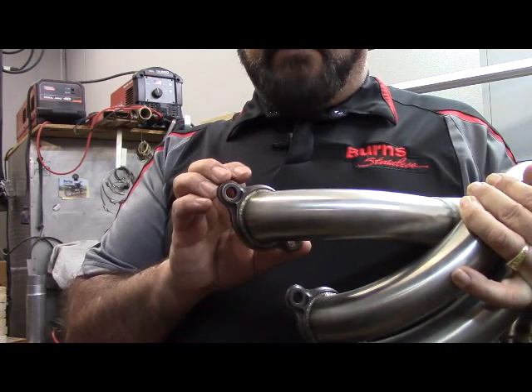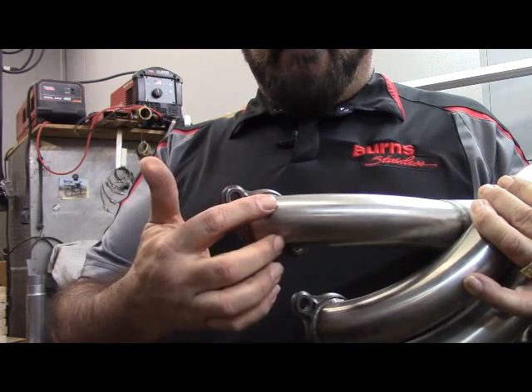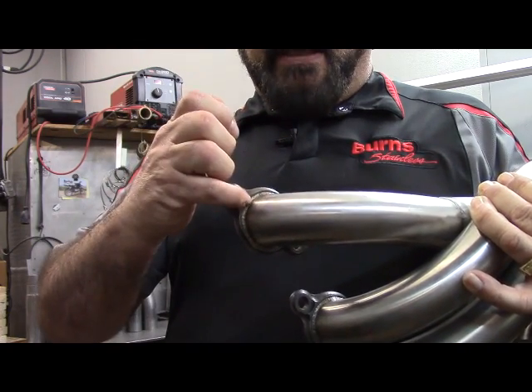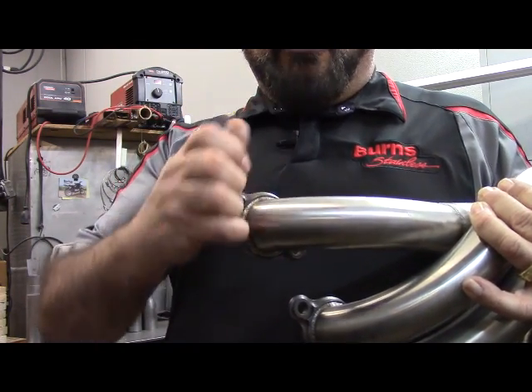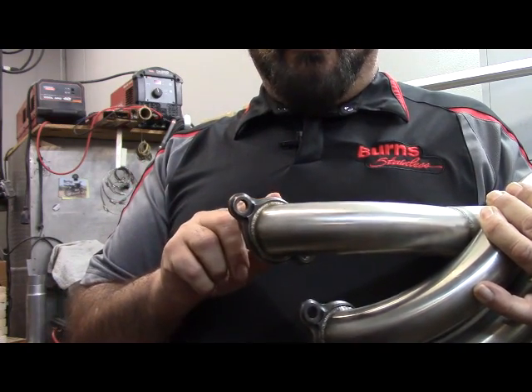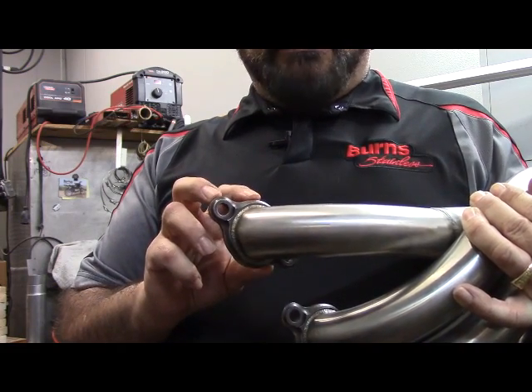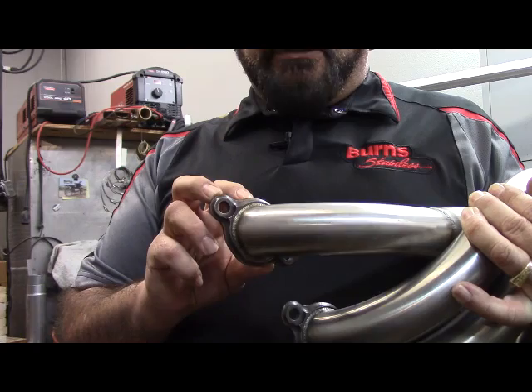This interface is important because you have a very stiff, thick flange on one side and a very thin tube on the other, and there's a lot of stress that occurs right in that region. If you penetrate too far and cause a stress riser, you're going to magnify the forces there, leading to cracking. That's one of the other reasons we like to use silicon bronze.